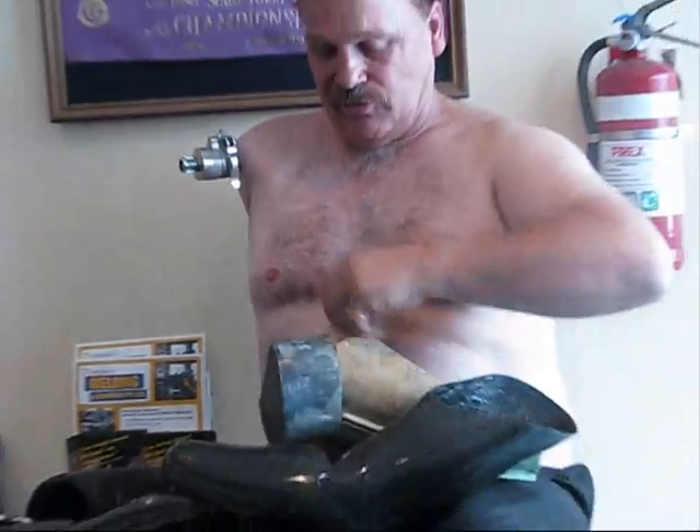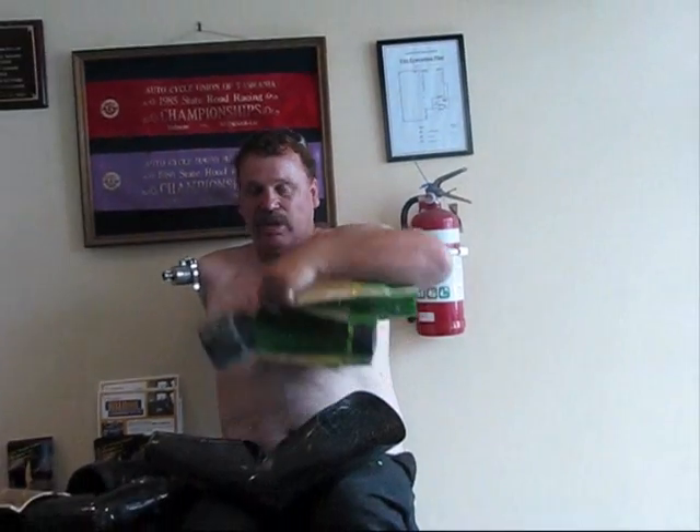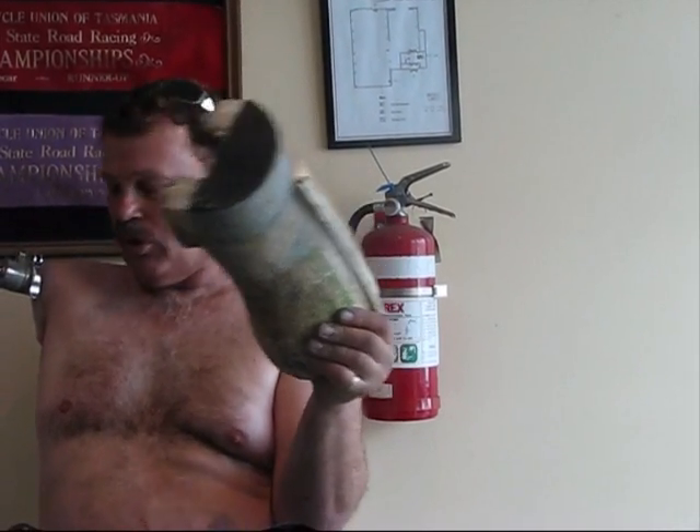This is a fibreglass mould of the lower section in two halves. These two halves come off — that is the two halves of the outer fibreglass mould to make this part. This shows you the mould of the forearm section of the upper arm taken off the 3D reverse copy plug of my left to right.